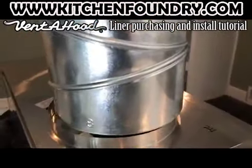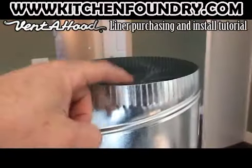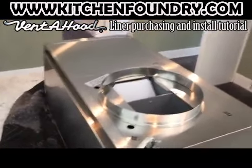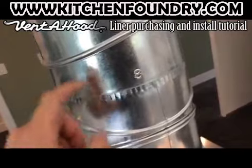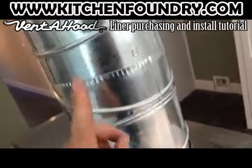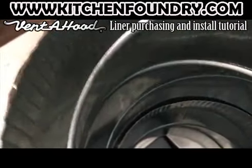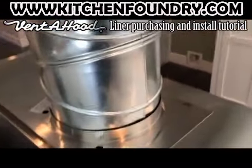So here we're putting the smooth side of the pipe just inside this ring, this 8-inch diameter collar, and we are going to metal tape the outside of this collar. I'm also going to metal tape each one of these joints of the articulating elbow, if I have the luxury of being able to access it from an attic space, or I can even reach up inside the hood and do metal tape on our inner joints after this hood's installed.